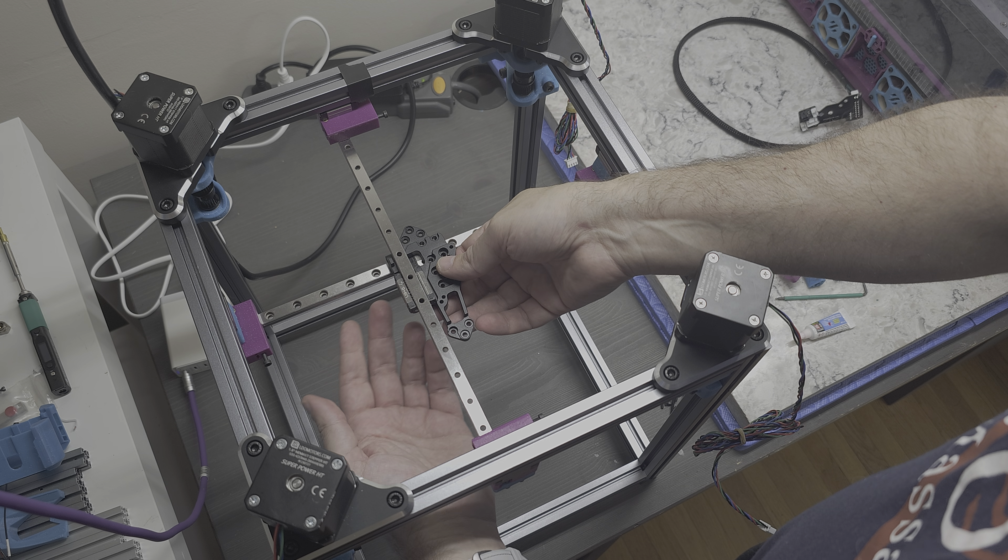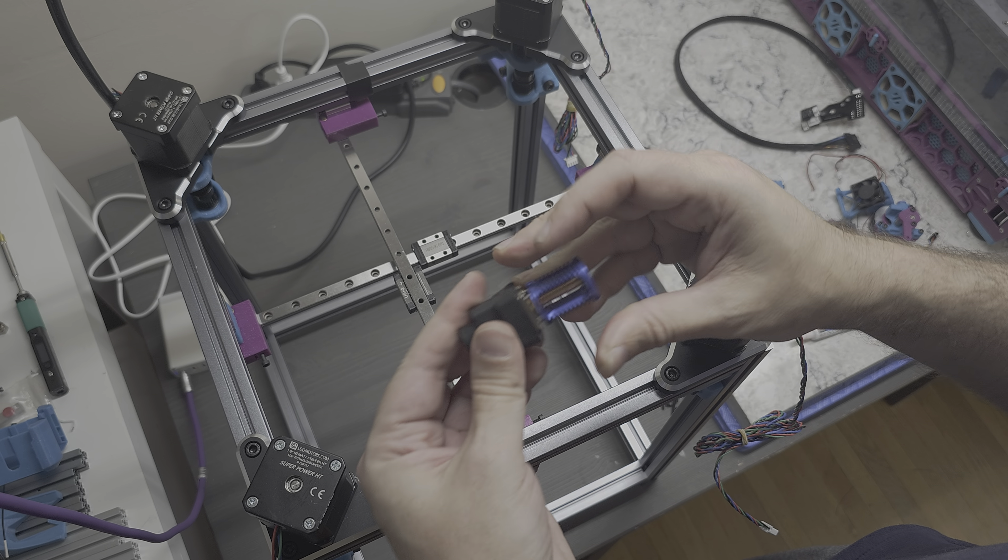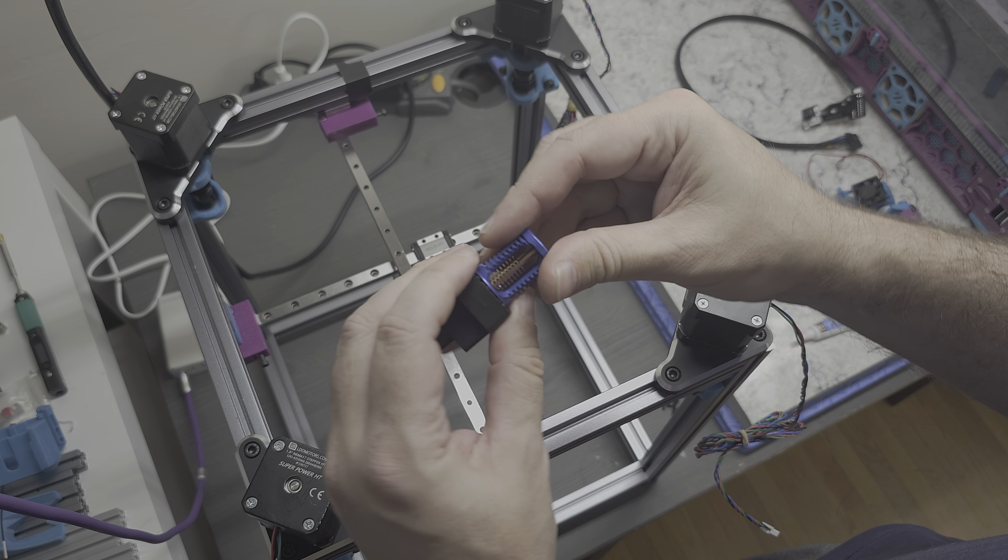For this hot end I'm going to be using a Dragon UHF, modified to what we're unofficially calling a UUHF. The way we do that is by putting a volcano-length nozzle into the hot end and using the hot end extender nut or adapter from a Rapido V1. That leaves only one break in the melt zone — just the one join rather than two joins if you did it a different way. I find this a little more stable and efficient, though people can do it different ways. So the Dragon UHF modified is what we're going with for this build.